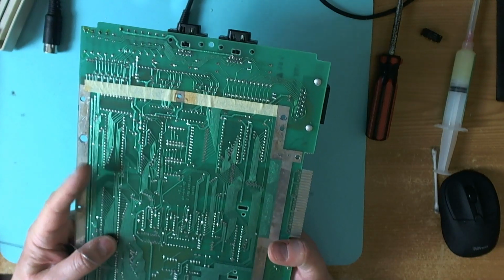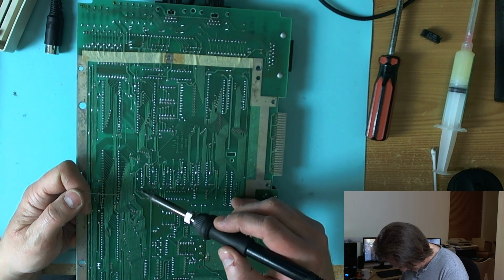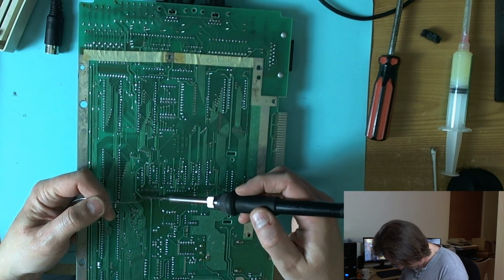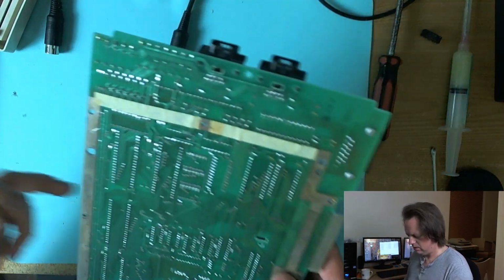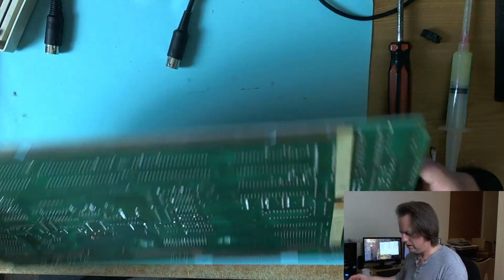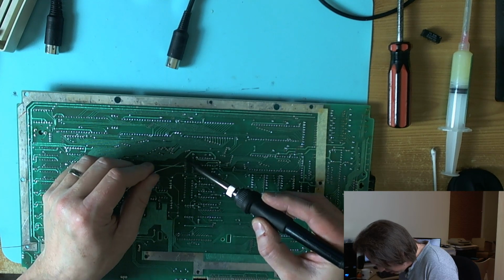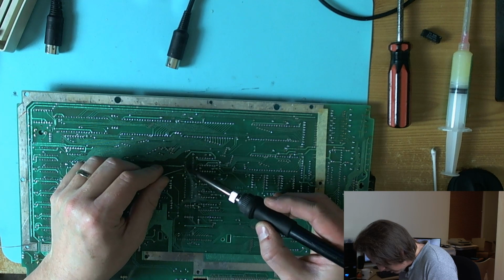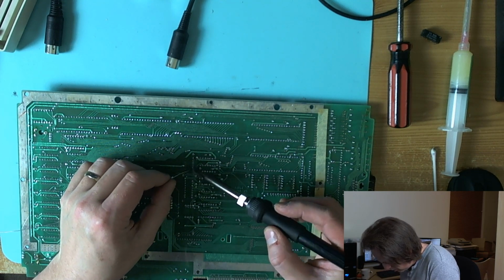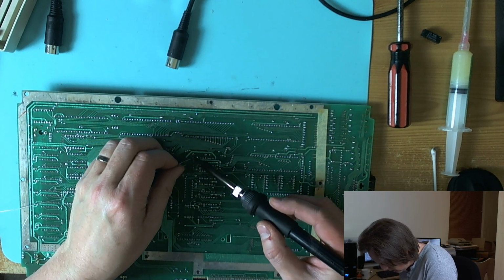To me, this whole procedure of troubleshooting is like a join the dots thing, because it's basically just following a script more or less of what's potentially going to be the problem. Preferably the easiest thing first. And replacing all the RAM isn't really a big deal, or socketing all the RAM, but I try to avoid it if I can. This board has the bigger chip socketed already, so it helps a little bit, but it's fairly obvious that everything works. Video works, GTIA works.